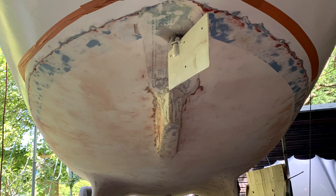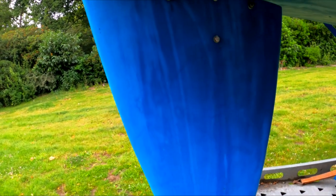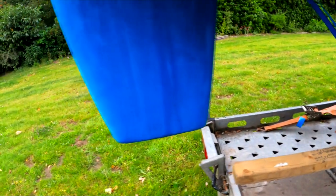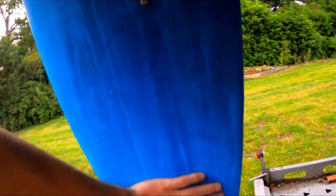Here we have the rudder that we've just fixed up. I've already bolted it up - you can see four stainless steel bolts with nyloc nuts so they're not going to come undone. We've done opposite side bolting which is good. The plate at the top sticks out and probably comes down to cover about a third of the rudder's surface area, so we had to build this quite strong. We managed to match it around the edges at the bottom, which is pretty good. You can see it looks even all the way through - a lot of fairing and sanding has gone into that and the antifoul has worked really well.